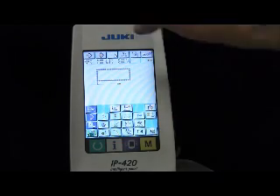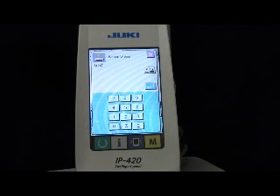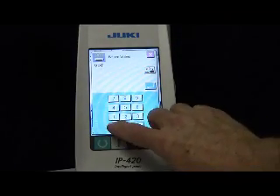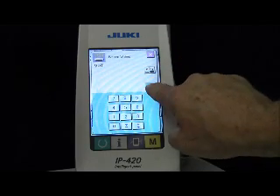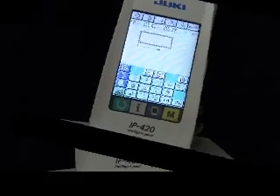Everything is good and you want to keep it — go up here and hit the save button. You'll notice right now it's telling you it's going to be on vector data. It's going to default to program number one — we'll just give it something else, like 99. You can save it in two different ways: the vector file. Just do this — pattern writing. It was just saved as 99 as a vector file, so when you go to read that out, you're going to have to change the little prompt on program versus vector. We'll show you that here.